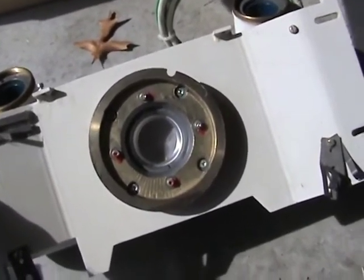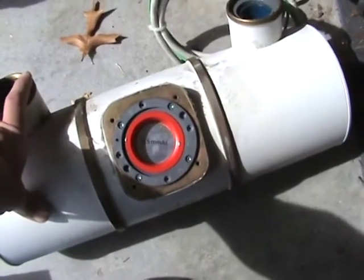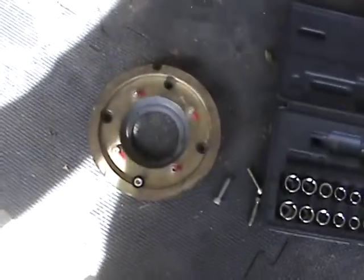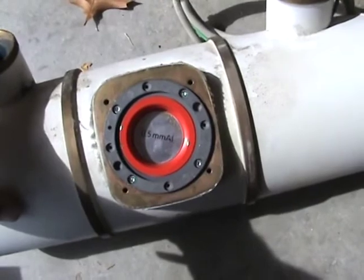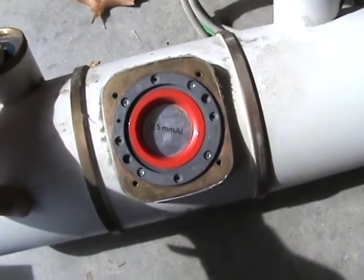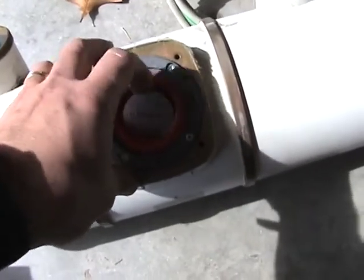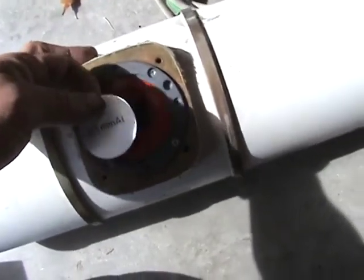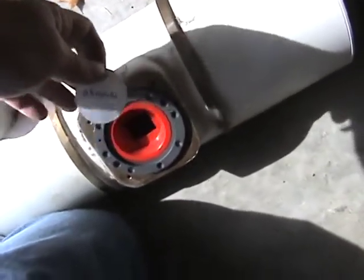We're back. I wanted you to see this - this is inside now. I've taken off this ring and also this protective cap. What I've got here looks like they've put a half millimeter of aluminum in here - some added filtration. It's just a little half millimeter aluminum disc and you can just take it right out. You may or may not use this thing.